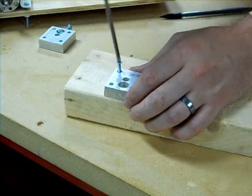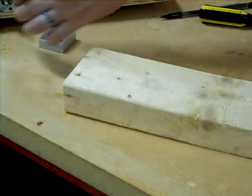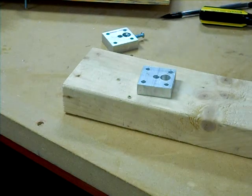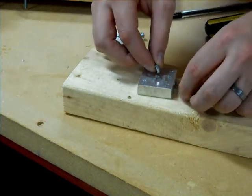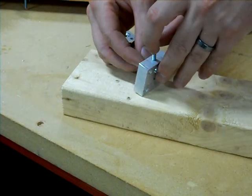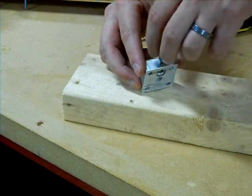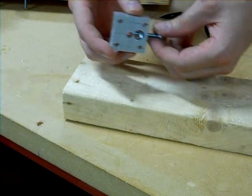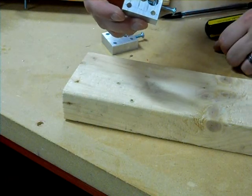There are other ways to make wheel hubs with slits, making it clamp, and so on, but I found this is just the easiest way. We can slide this easily on the shaft. If we get a number eight bolt and a number eight nut, we should be able to put this together. You have to put the nut on the inside — sometimes this is tricky — but put the nut in the hole, get it threaded onto the bolt, and just tighten it. Now you can put the shaft in there and tighten this down, and the nut will stay in place because of the top of the hole. And there you've got an awesome hub.